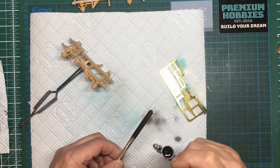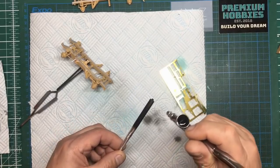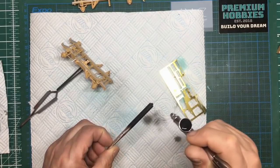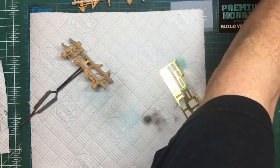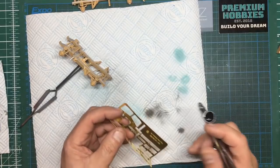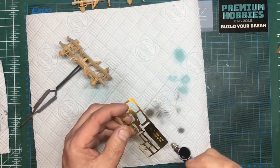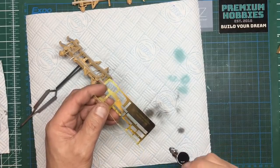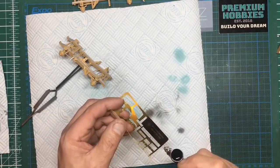I'll do a little bit here and then finish off with my extractor on and the window open. As we can see it has gone down beautifully. My main reason for trying this out is that primers for metal don't etch — they just rub off easily. I'll dust this on lightly; as you can see it's drying behind me, pretty much straight away. Then I'll put a wet coat on, and if it has etching capabilities it will use the wetness to do its thing.